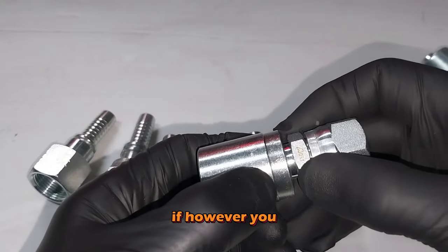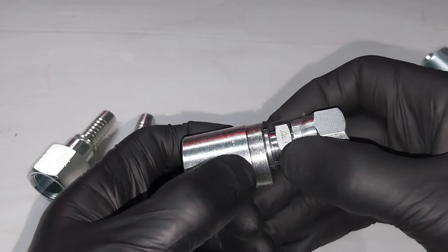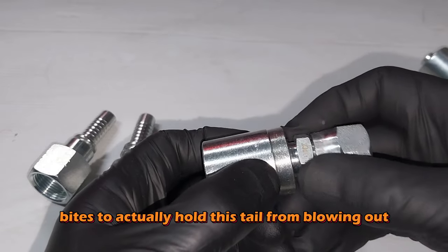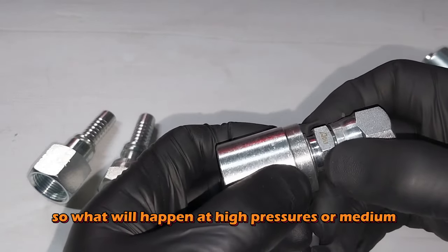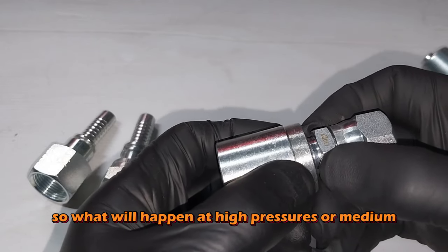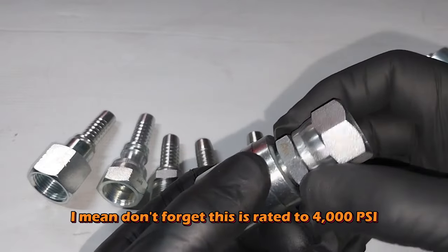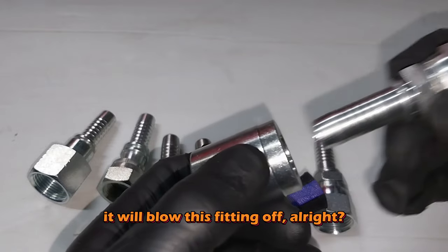If, however, you miss and you crimp on the shoulder, or you crimp here, even though you reach the right diameter, there's just not enough bite to actually hold this tail from blowing out. So what will happen at high pressures, or even medium pressures, I mean, don't forget this is rated to 4000 psi, and medium pressures, it will blow this fitting off. All right,